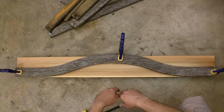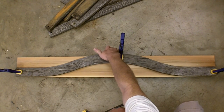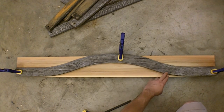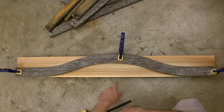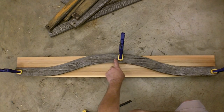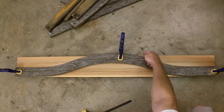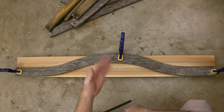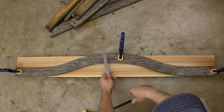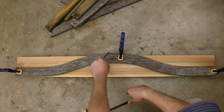I'm going to explain the order in which I need to do things here. If I just cut these off and cut this out, it's really only hanging over three-quarters of an inch, and I would have a very small piece to glue on — I didn't like that. This was originally made in three pieces, but I'm going to make it in two so I'll only have one glue joint. If I go ahead and cut everything out, I won't be able to saw this line right here because I won't have any backer. So what I'll do, since I need these scraps, is cut these off first, then send it to the table saw and cut this line across here at four and a quarter inches — that should get me about an inch and a half of material on top.